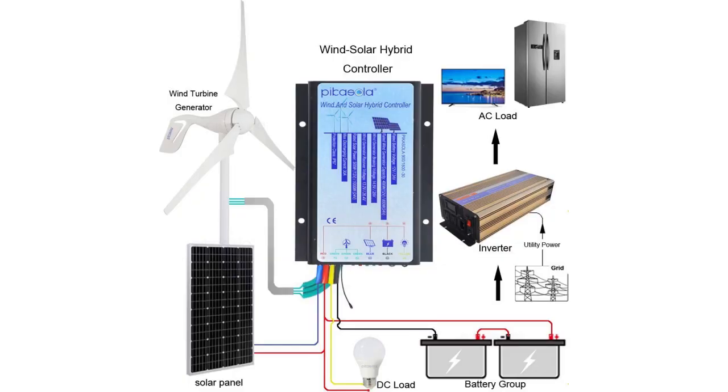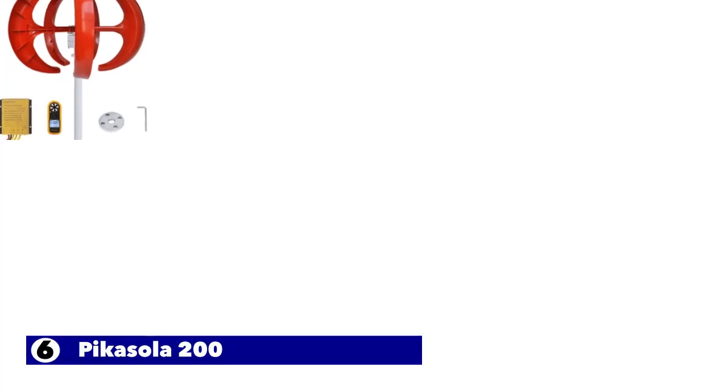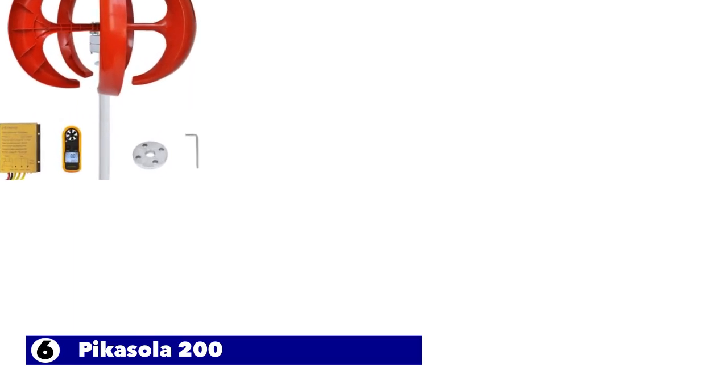A typical wind turbine connection involves wiring from the wind turbine to the charge controller. From the charge controller, the 3-phase AC from the wind turbine is converted into DC, goes into the battery. From the battery onwards, you can directly connect the battery to DC loads, or if you want to connect to AC loads, you'll have to go through an inverter, which will be an external product. Let's look at the top 6 wind turbines in the US market today.